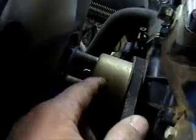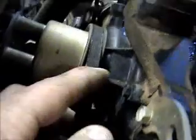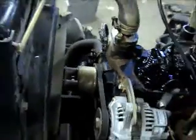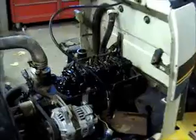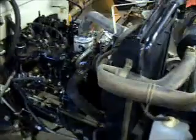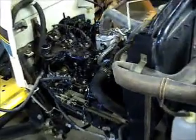That head crack comes part right down here, which I also got to take the fan off, the pulley, all this crap. The water pump's got to come off. No, it don't have to come off just yet. I have to take these two bolts out, one there and that one over there, so I get that head off. Once I do that, I'll turn the motor over by hand and see how bad the cylinder walls are. If they're real bad, then I'll just go ahead and start taking all this stuff off and break the tractor apart. But anyways, I'll get back to y'all here in just a flash.